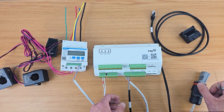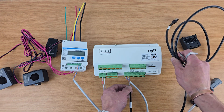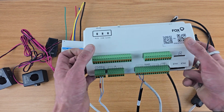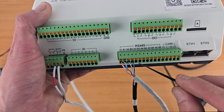We will then take the supplied network cable and we will need to cut one end off of that network cable on the Smart Logger side. We are going to use green-white to A2 and blue to B2.